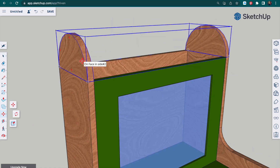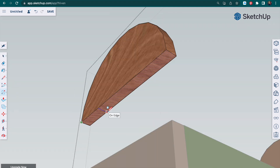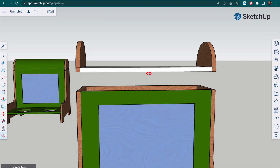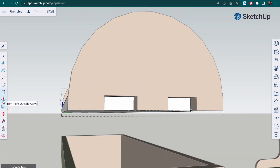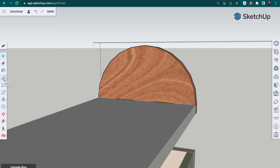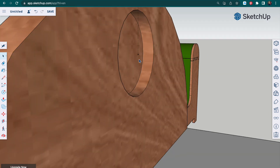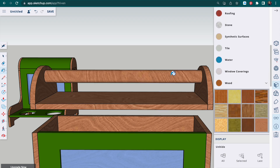I need to update my SketchUp model before actually making it. That way I can work out the correct dimensions before making, which should save time as well as provide more evidence of development for my portfolio. Make sure that you're being as accurate as possible with any CAD models and record all stages of development. When taking screenshots, consider how you're going to communicate any development as clearly as possible. You might want to show your design from a variety of angles, show how parts fit together through an exploded diagram, or select elements of a third angle projection that provides accurate dimensions.